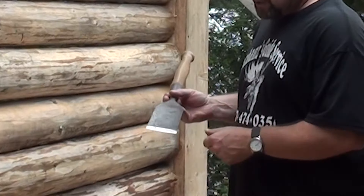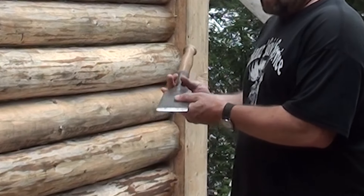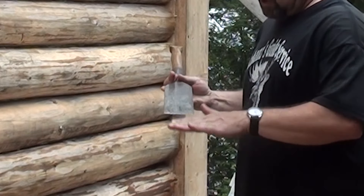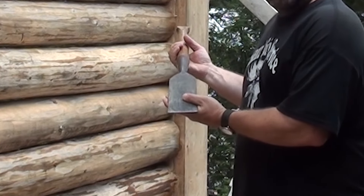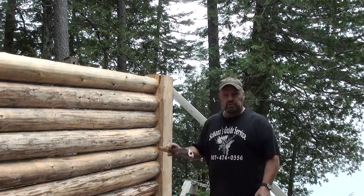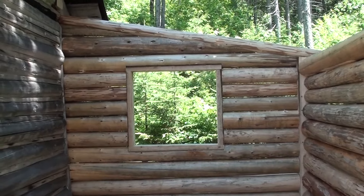You don't pound on a slick — it's a nice big heavy tool and you grip it in your hands and slide it, using it kind of like a hand plane. One other point: when using it, take your beveled edge — a lot of people do the same thing with a chisel. If your work surface is down here and you use it bevel-up, it has a tendency to dig in. You actually want to turn it around, beveled edge on the bottom, use it upside down. That way you're not digging into your wood — just push it along. Good tool, every log builder should have one.